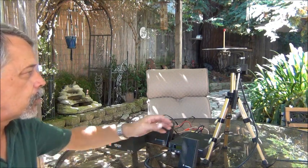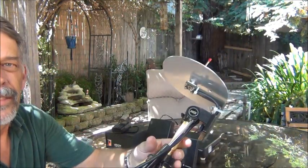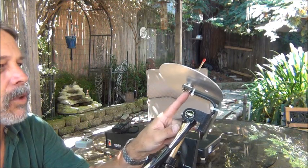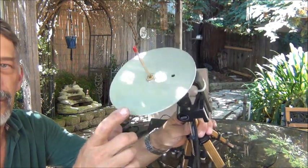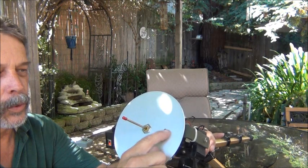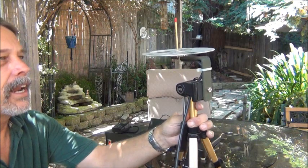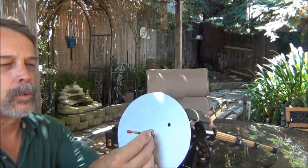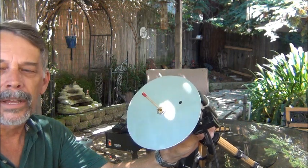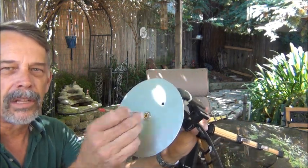This one is made with a SO239. I had a little bracket that I bought at a ham swap that already had the SO239 on it. Instead of putting radials off of this, I cut a piece of aluminum, and it already had a hole drilled in it here. This gives the ground plane, and here's the radiating element. This radiating element is cut to 927.5 MHz — it's about 3.1 inches long — and it actually just plugs in.